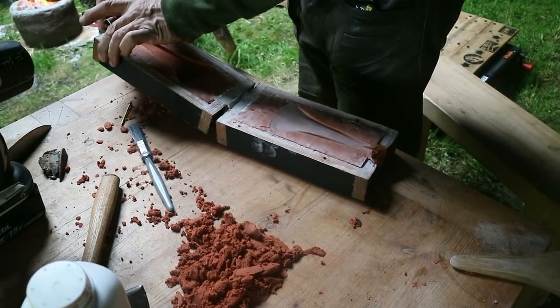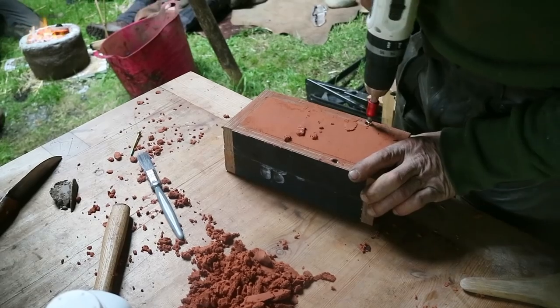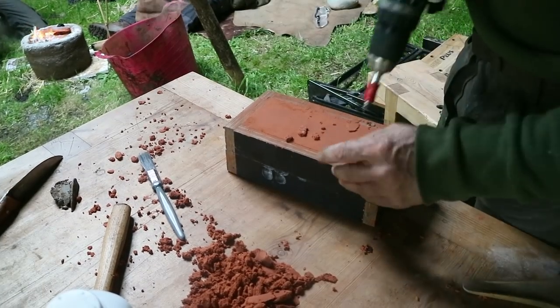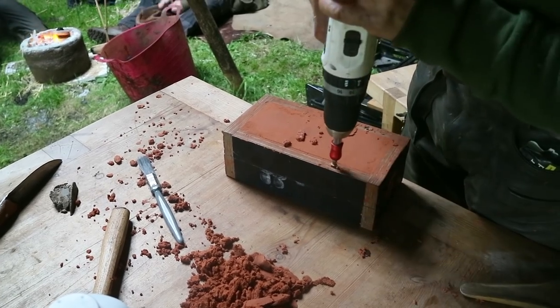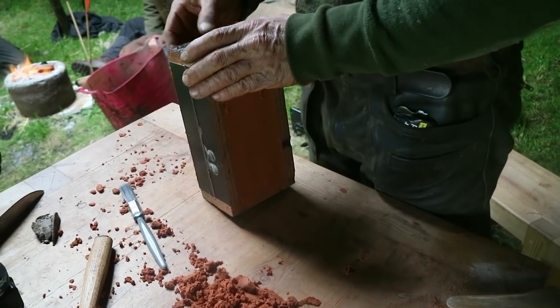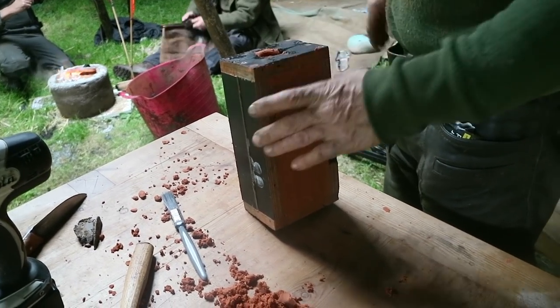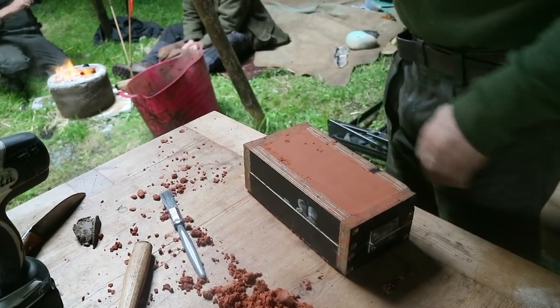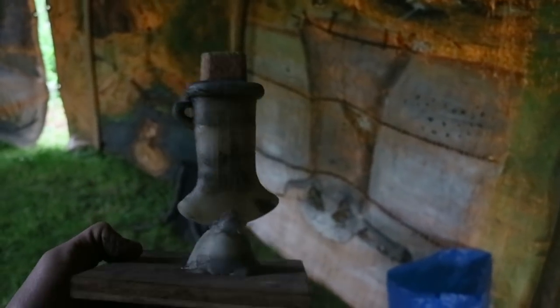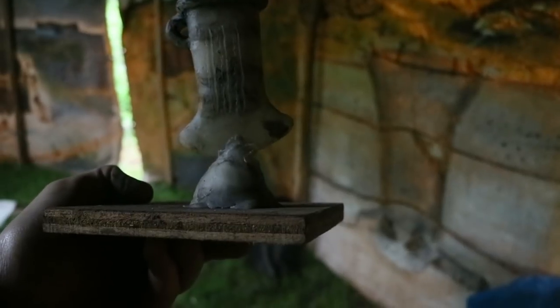Paul has got some dental tools — there will be a scope in there you might use. So what we have is a sandbox, good to go. All we need is to have that ready, set up behind there. When we get some bronze which is ready, we're good to go. That is where the hole is going to be for the shaft, and there is the axe head with the three lines, relatively smoothed over, with a hole for it to be bound on with. That should cast out pretty nice. And there is the pouring cup that it's currently mounted onto.